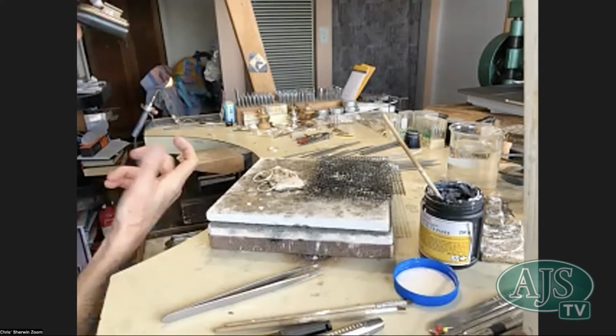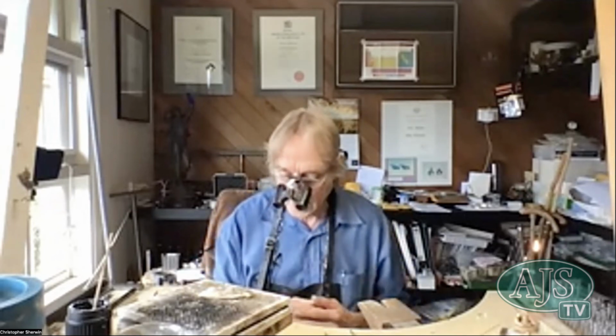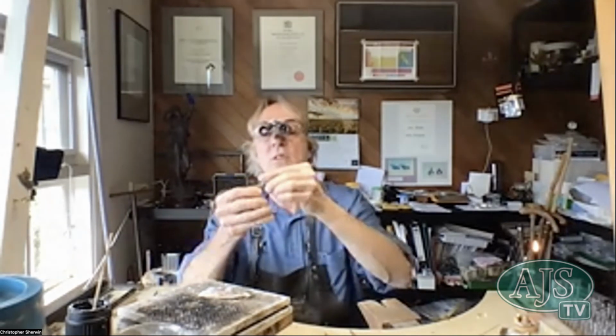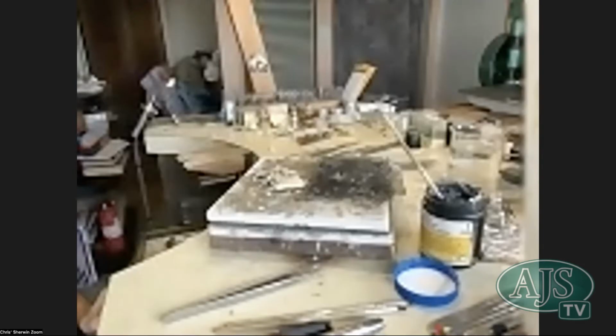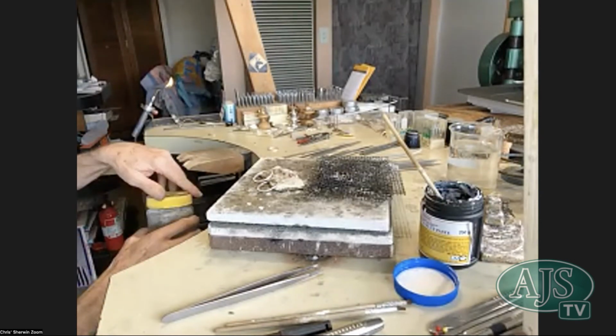I probably once would have used pliers to resize, but I find that's a little bit damaging, and you can end up wrenching at the setting anyway. And as I said, with rings like this platinum ring with the shoulders on it, everything's above the band. You do have to be very careful that you're not damaging the top area of the ring. So again, that one I might plier out a little bit because I don't want to be stretching this and then distorting under the setting. So it's a good question, and it's difficult to answer because every case is different.